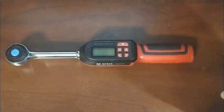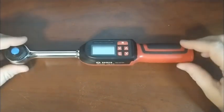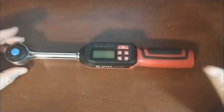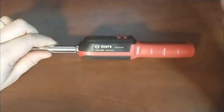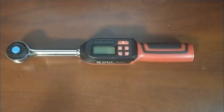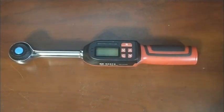What I like about this particular unit is there are very few compact digital torque wrenches out there. Most are either going to be high-end brands or really generic names you've never heard of, and I think this company has a good chance of grabbing some of the Amazon market as they do have a couple of different compact units. Four models in the series — you can get one that is longer with a higher torque rating — but frankly this is what I need and what most people need. In a digital torque meter, compared to a conventional wrench at plus or minus ten percent, this is really going to be close to spot-on, and being digital it self-calibrates every time you turn it on.